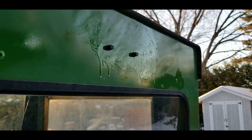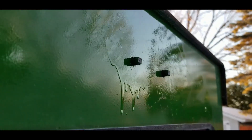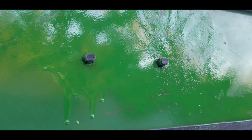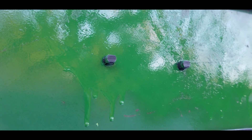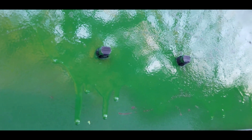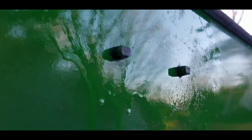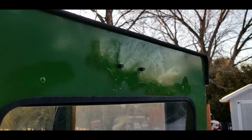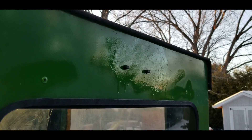To give a little more detail about what it took to mount that: the holes for the bracket that holds the tool need to be three inches on center. I drilled two small pilot holes and slowly worked my way up one drill bit at a time. Ultimately, the hole size that fit those plastic tabs that stick out was 21/64 — I thought it might be a quarter inch, but a quarter inch is way too small.